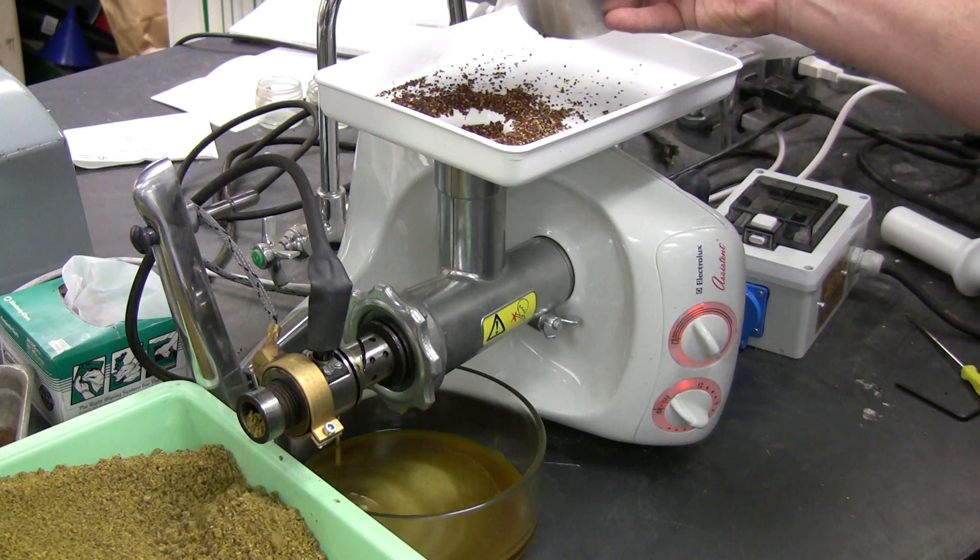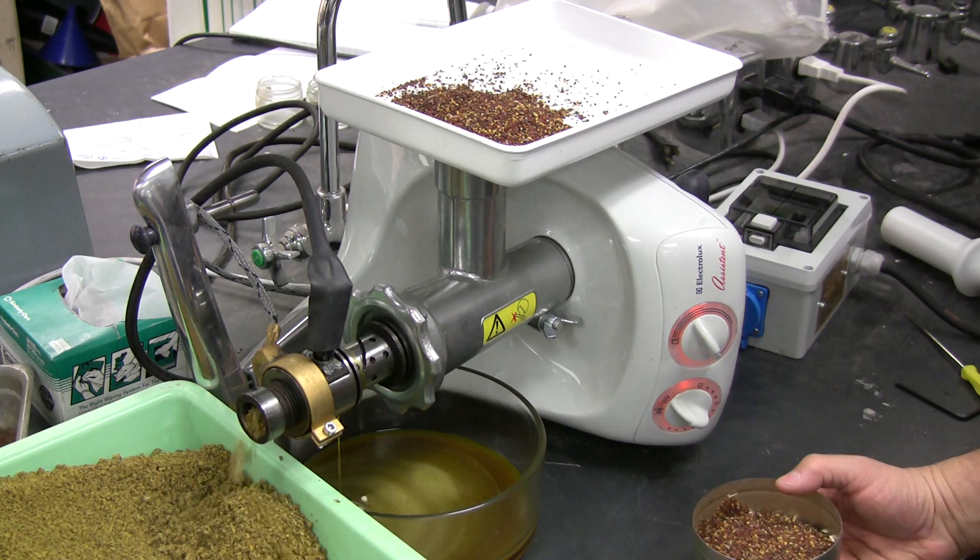After all that's been done, we go through and actually just plug this in and let it heat up. It's got a heating element up front, and then we just fill this up and let it go through the crushing process. We collect the oil out, collect the meal, and separate the two.